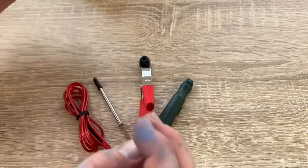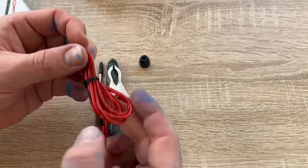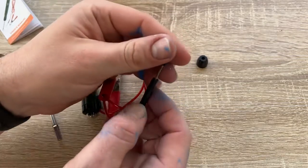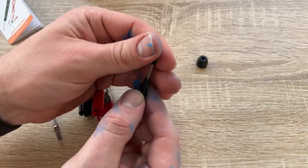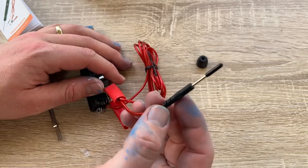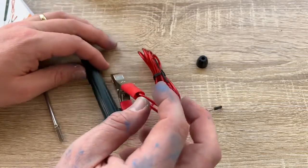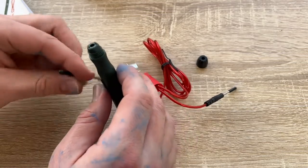These pulse signals can be measured conveniently and quickly. For load plug testing, you can use the probe attached to the clip combined with the main probe to directly measure — which is convenient for fault diagnostics. The voltage polarity display function uses red and green LEDs to distinguish the positive and negative polarity of the power supply, which is intuitive and fast.